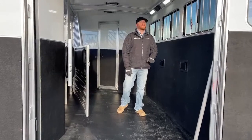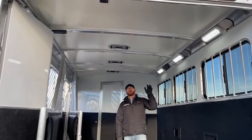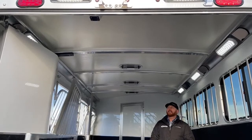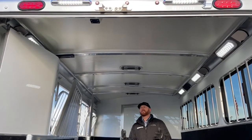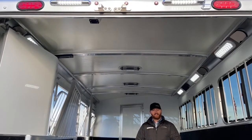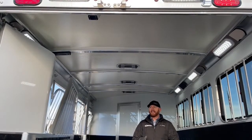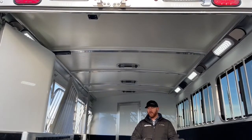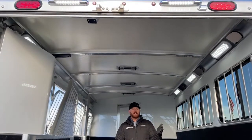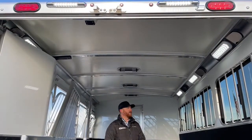We have the strongest upright posts and then we cap it off with an insulated roof — we talked briefly about that up front. This insulated roof is standard on every Cimarron. It keeps the stall about 20% cooler than aluminum sheeted roofs. I can jump on that roof, walk on it, I can't dent it. It'll take substantial hail. But in my opinion, the most important thing about that roof is the stall temperature — keeping animals nice and comfortable. We've put thermometers in trailers here on the lot in the summertime, 95 degrees out here on this asphalt, and when you peek through the windows there is usually a pretty decent temperature difference between a Cimarron and another brand. So it does make a difference. If you see us at shows in those hot summer months, we might have an easy-up tent outside with a fan, but it's cooler in the trailer.